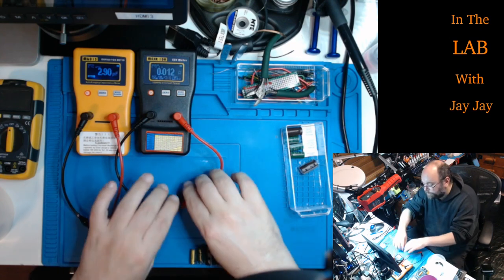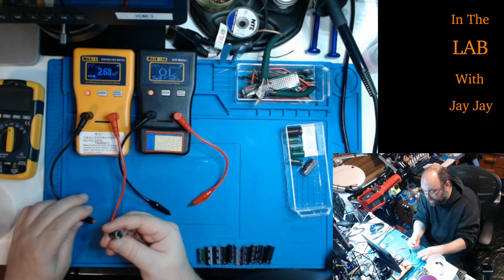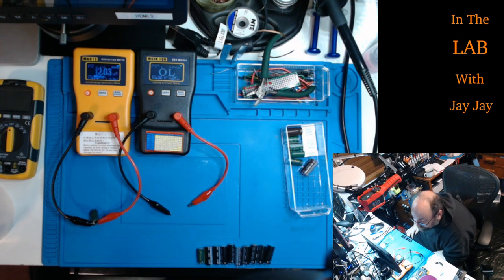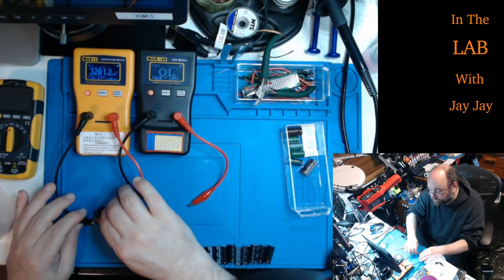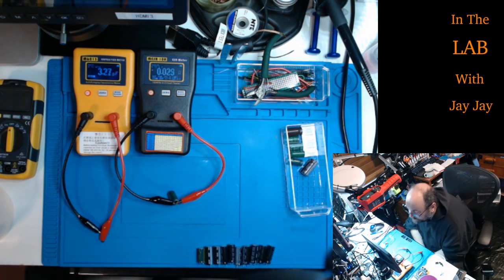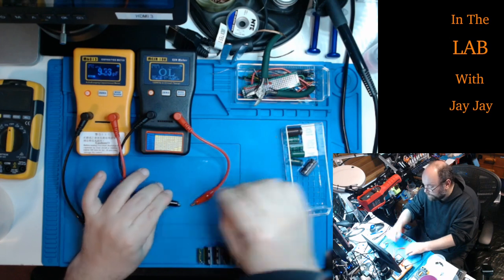That's well within spec as well. And this guy is supposed to be the same, 3,300. And up it goes, 3,200, that's pretty close. And the ESR is low. So pretty happy about that.